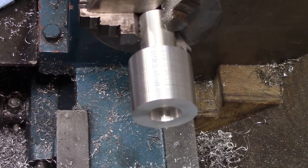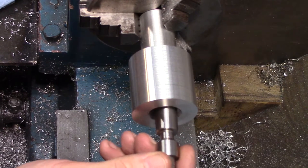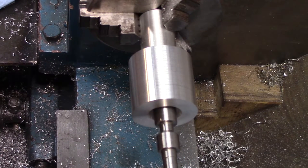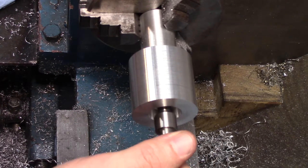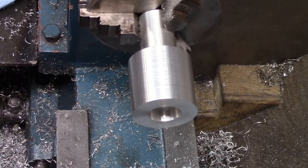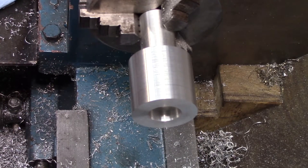What we've done here is take the important cuts in one turning - this has not moved. So I've got the bearing pocket, the shaft pocket, and by the way this is pistoning now - it's tight enough to where it actually won't let me push it in all the way because of the air. So that's close enough, we can hand finish that. It's pistoning because I haven't cut the other side off yet. The reference face - all those were done in this turning. I can go ahead and cut the outer face with it sitting just like this, and then all I gotta do is flip it, hold it, and cut off the excess.